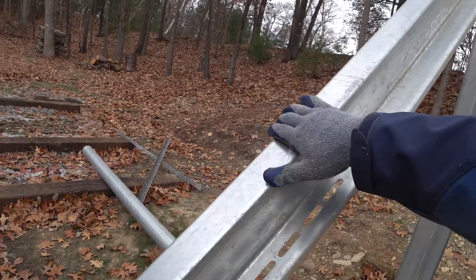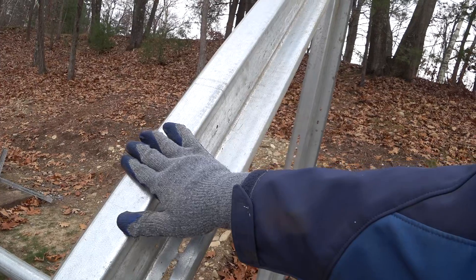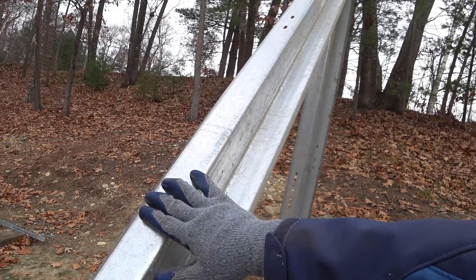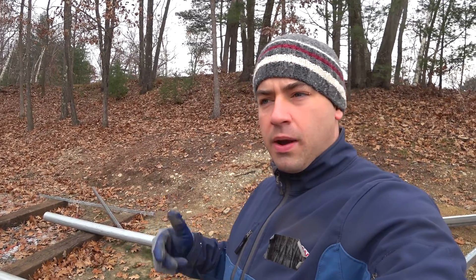This front face is a 47 degree angle off horizontal. I am at 42 degrees north latitude in Massachusetts. I think the 47 degrees is a little bit steeper than ideal for my location, but I am not trying to create the most amount of electricity throughout the year in kilowatt hours — that is for grid-tie systems. What I want to do is try to create the same number of kilowatt hours in December as I do in June.